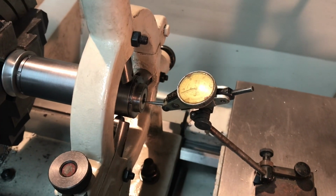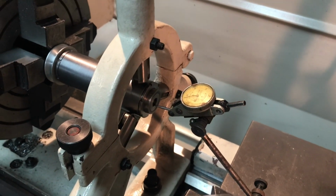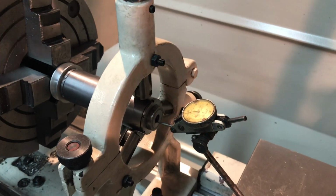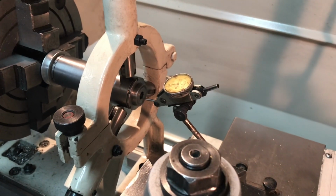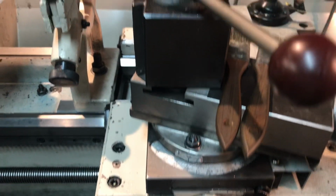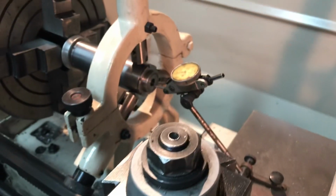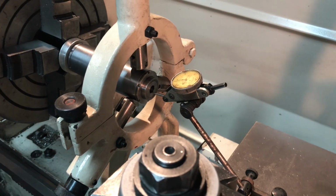And I know that the WW collets that I bought from Shoreline to be my little test pieces were certainly about that tolerance too. I noticed that when I was setting the 20-degree angle. So I think I'm all set now, and I'll probably get up and cut the angle pretty soon here, and I will bring you back for that process. I'm going to do it just like Maddie did, basically.